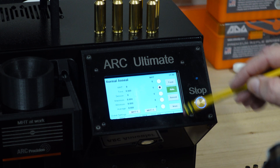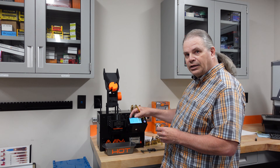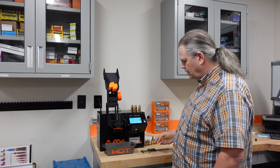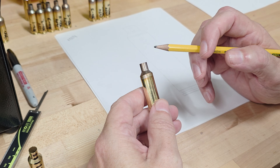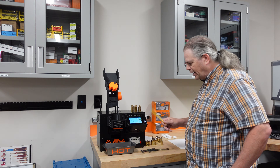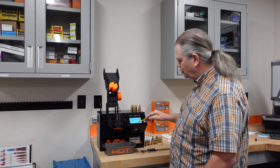At this point I'm ready to test my first shell. I'll go to the main menu, into normal mode — the base drops down and the datum pulls back, so make sure there's no shell in there to start. I'll set it to auto mode; as soon as you drop the shell in it starts the anneal cycle and then drops the hot shell out. The shell drops out hot — don't reach in and grab it. On a previously annealed shell you can see the color line, which gives you an idea of how much anneal was done. If the color line is a little too far up in the shoulder, the shell is probably too hard, indicating not enough anneal.